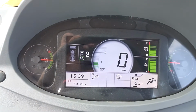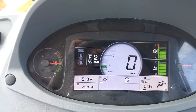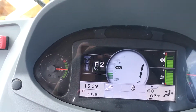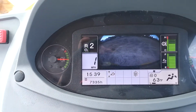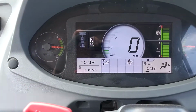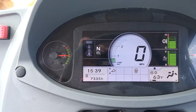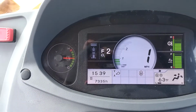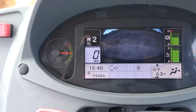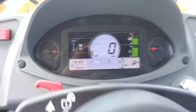It's actually holding it, so you have all wheel rotations. All your wheels are actually turning at one time, so you're not just having slip, because if you let it go, it'll just be slip. Normally it's all-wheel drive. On most of these style vehicles or heavy equipment, it's all-wheel drive. In this case, it allows you to catch it so that when you hold it in, all 4 tires turn at the exact same time without you slipping. It really comes in handy when you're going into the mud and you start bogging down or something like that. But it really works real well.